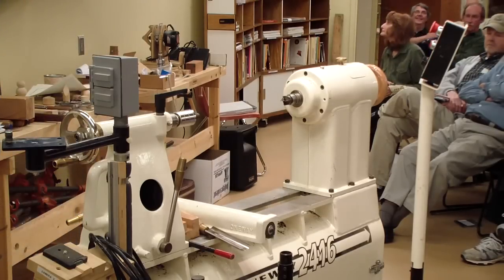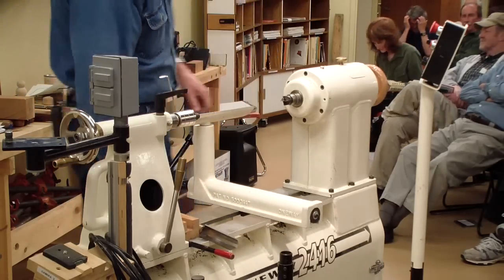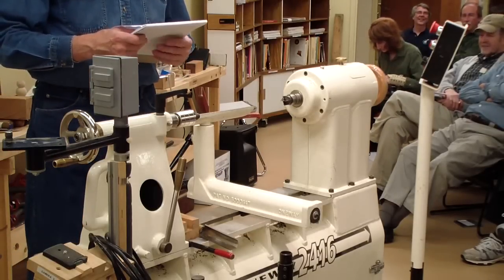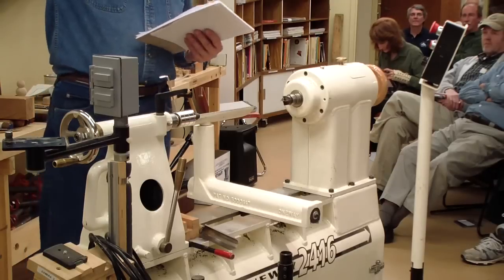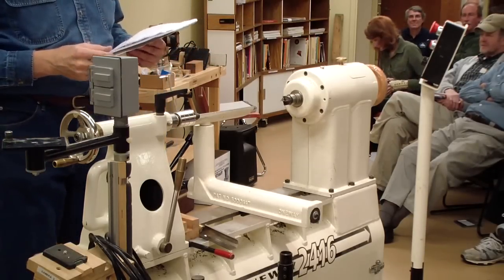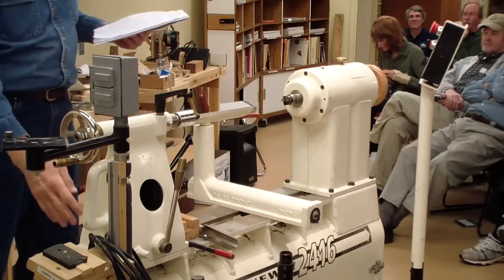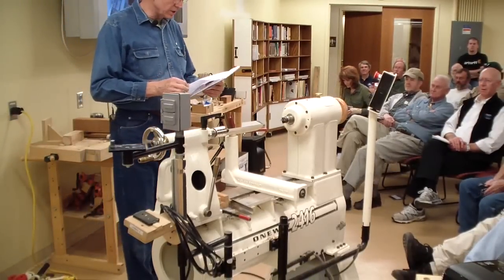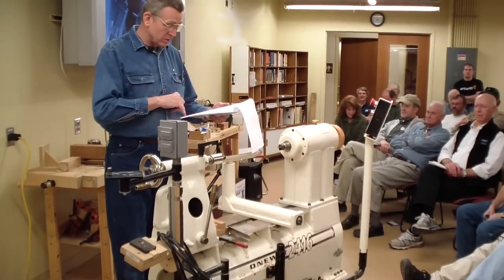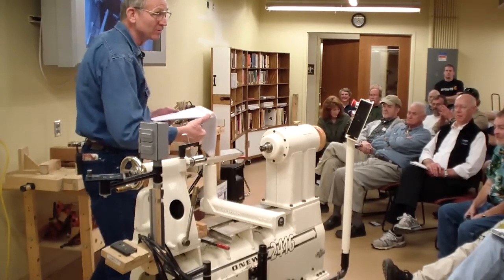I have a good lathe. What are the ways made out of on your lathe? LVL, laminated veneer lumber, and angle steel. I think it's 4x4x3/8 angle. And I can go 9 feet on the centers, and I don't have to have a little leg in it. So it's pretty nice. You need a hose clamp for that thing too, to hold your little lid lock there. That's it.